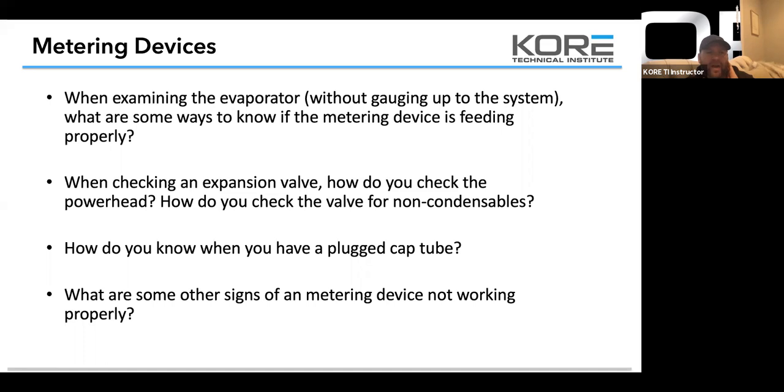The other thing you can check that's a bigger problem, if you're having a lot of expansion valves in like a market application, check your oil. Oil flows with the refrigerant. If you've lost the viscosity or the oil looks terrible and nobody's changed it, and your valves keep sticking, it's because your oil's bad. We've had it on a couple stores that we've taken over where the oil has never been changed. We've got a company out in our area that doesn't believe in changing oil.